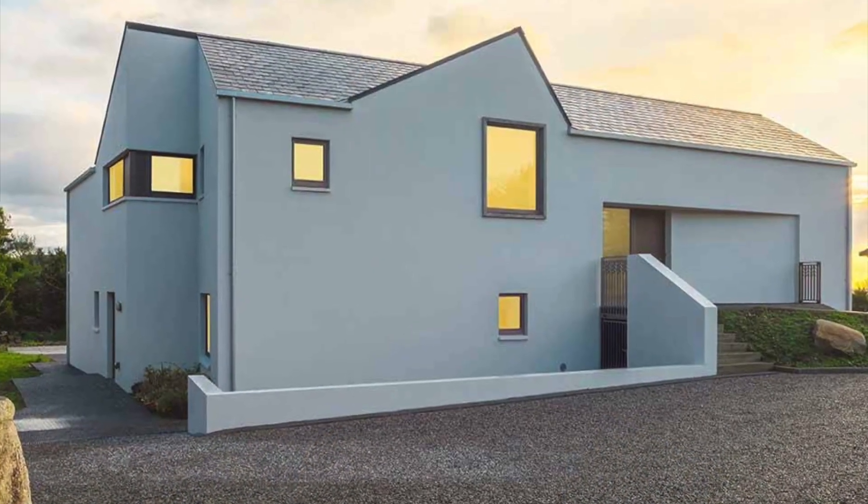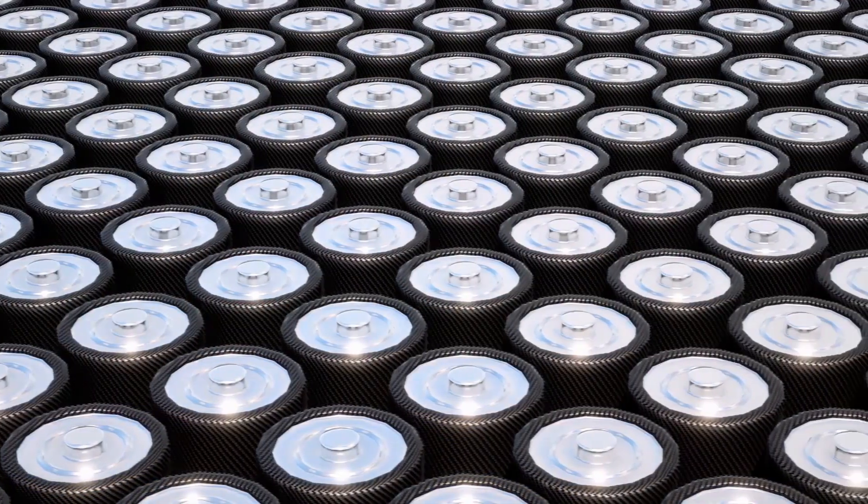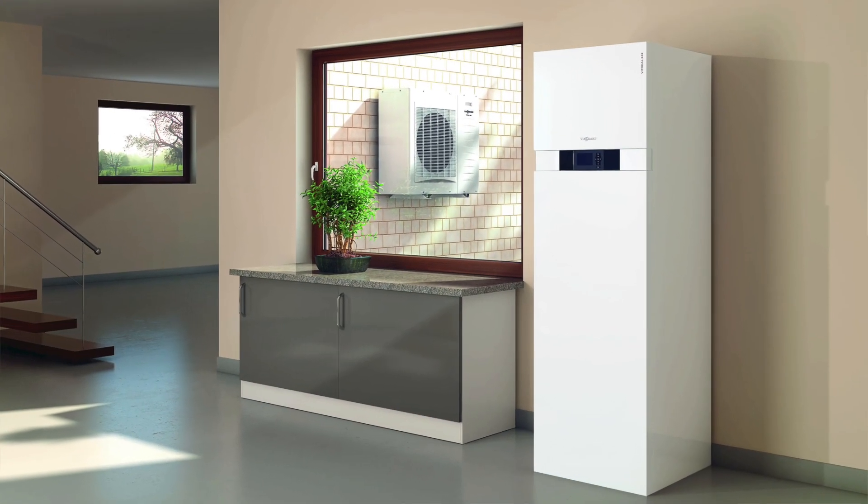Now you know what size of heat pump you need. Passive homes are insulated such that it takes days to weeks for them to cool down. Assuming you have regular insulation and want to maximize mid- to long-term savings using your own battery storage, there are two types of storage: chemical energy in a battery — typically lithium ion — or thermal energy, so heat, in a water tank. The latter is a solution for air to water systems that I highly recommend.